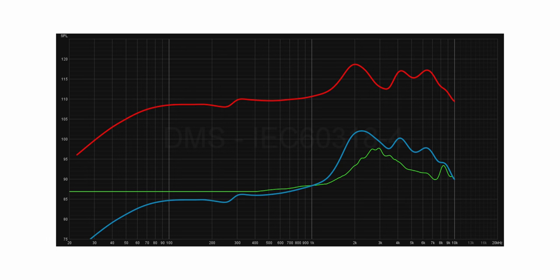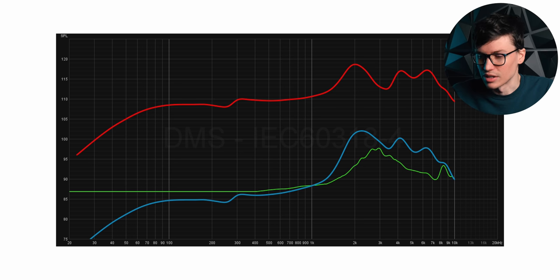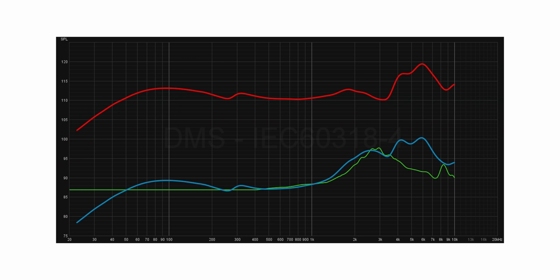This is the Grado SR60X with the stock S-pad. As you can see, it doesn't have hardly any bass. The mid-range is relatively flat but does slope down the lower you get, and the treble — there is a lot of it. This, however, is the G-pad. While not perfect, you can tell it makes a big difference. We actually have bass now, and the treble, while still a bit more excited in the 5 to 7kHz range, the rest of it makes a lot more sense. In this configuration I like the SR60X a lot more, and the G-pads considerably improve the already very interesting stage. If you're thinking about this headphone, I know it adds an extra $20, but really consider getting the Geekria G-pads — that is the way to use the SR60X.